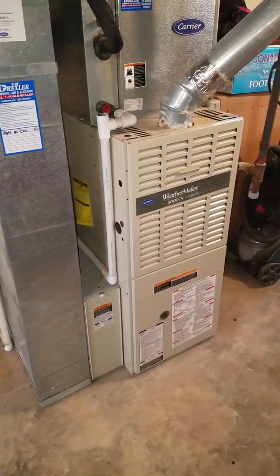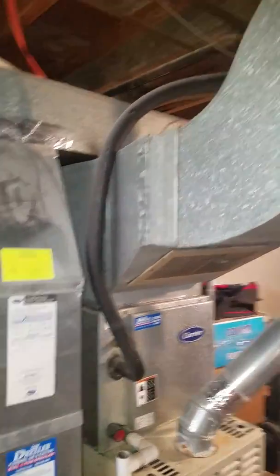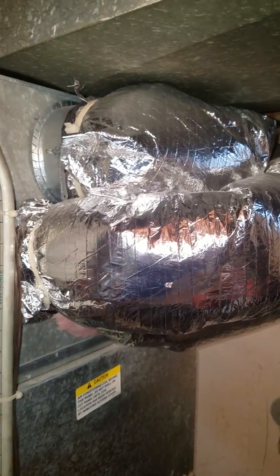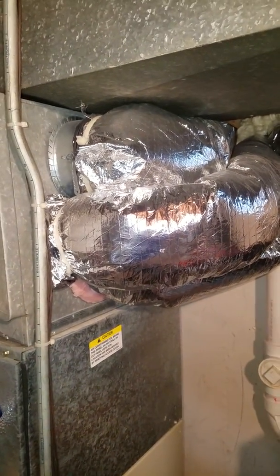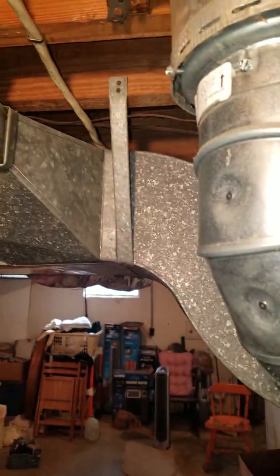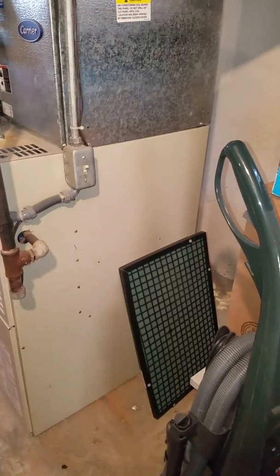Here's what you're looking at on your full system. Here's the top of your supply. This is what I don't like — there are three flex ducts going into here, and they've got scoops in them, but they're just coming right out of the top of that supply, which is bad. They really should be coming over here and hooked to the supply area up on top of the ductwork if possible.